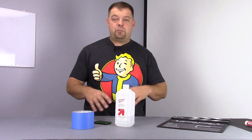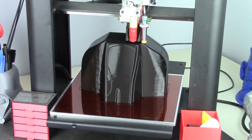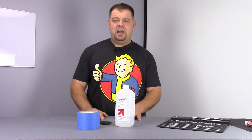There are some things, like when I'm printing something that's very large and has a very big surface area, I tend to print it on the Kapton Tape or on the PEI. But if I have something that has a very small surface area, then a lot of times I'll use heavily prepped blue painter's tape because it just provides a better result.